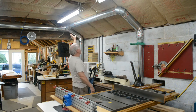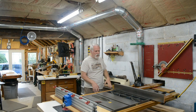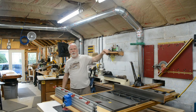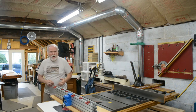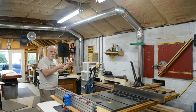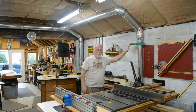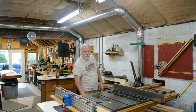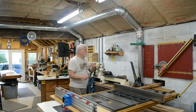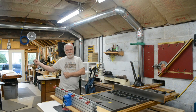This one comes across from the table saw. I ran 5-inch through here, then dropped to 4-inch for my vertical rise to give me the most suction from the table saw going back up. My dust collection used to be inside. I got a little residual dust, but I had mostly plastic-type piping, which creates turbulence and reduces airflow. I wanted to go with this automatic gate system where all these gates have motion sensors that pick up vibration off the motors — they open the gate, close any other gates, and then turn on the dust collector.